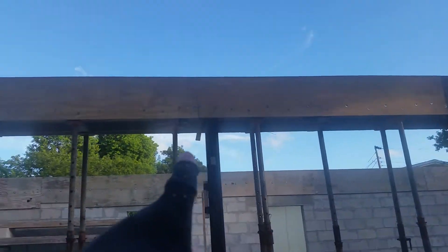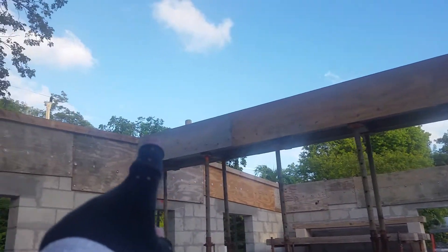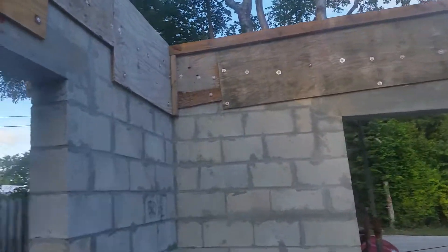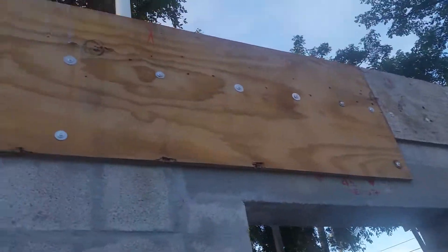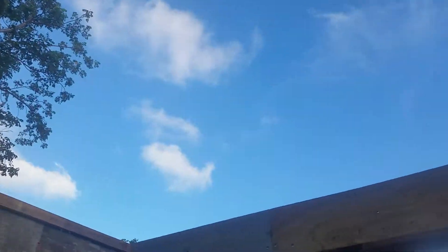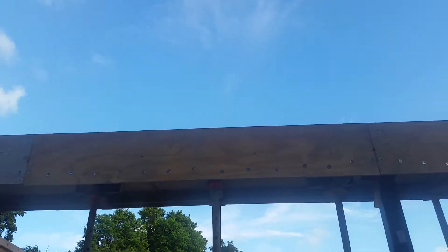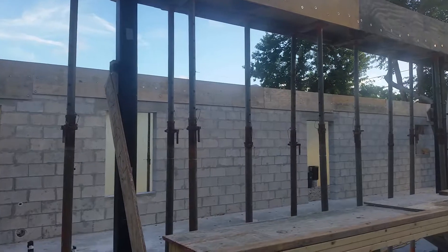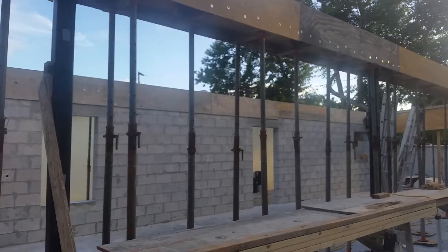You can see the beams are all going to be filled with rebar — there's number six rebar in here, number fives and fours. This is all going to get poured and covered with plywood, and there'll be rebar on top eventually. It's going to be fun — maybe two more months, maybe six weeks before we're pouring concrete.